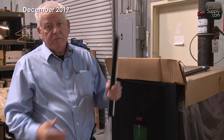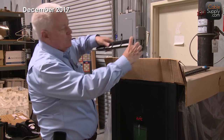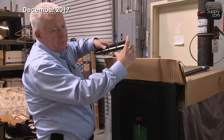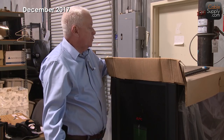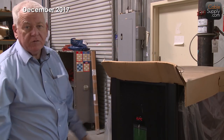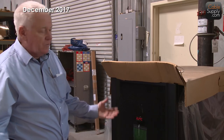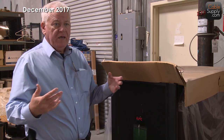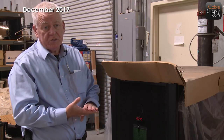This works with all of them — standardization, the U system. This is a 1U. If you had a 2U, it would be twice as big, and a 48-port is going to be 2U. Just think in U's when you order these things — don't think in feet or inches. Just about every piece of equipment that goes in a data rack is 1U, 2U, or 4U for routers and switches, or bigger.